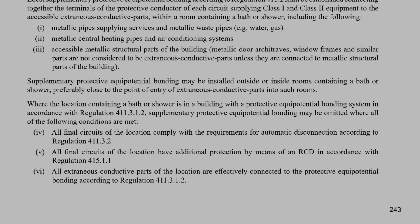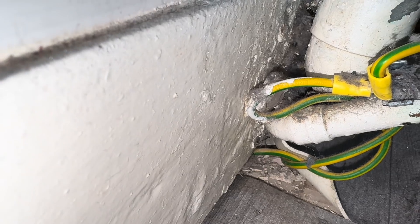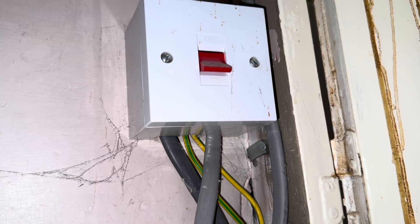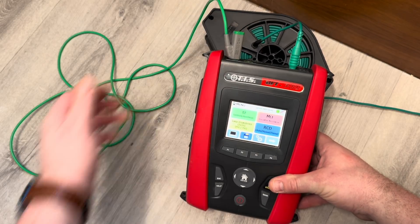Immersion heaters are another good example of a circuit that should be tested to the very furthest point — who knows what kind of horrors could be lurking inside. So do we need to test supplementary bonding? It is often found in bathrooms but could be located in other special locations, and it is to reduce the risk of electric shock between two separate metal parts like pipework or radiators. The need for supplementary bonding has reduced as regulation 701.415.2 says that supplementary bonding can be omitted if an RCD rated at 30mA or below is present on the bathroom circuits. But when we don't have an RCD protecting the circuits and supplementary bonding has been installed, we need to test it to ensure the resistance between metalwork is suitably low enough. Supplementary bonding is usually connected into an electrical accessory like a shower pull cord or switch and will run in 2.5 or 4mm² single insulated cable to each extraneous metal part, also linking together any electrical items in the bathroom.